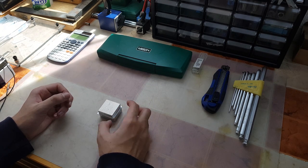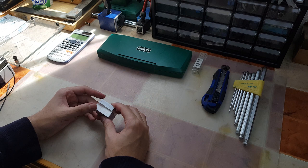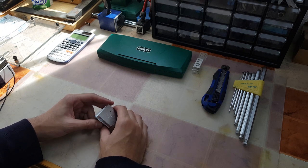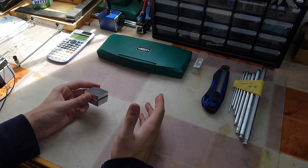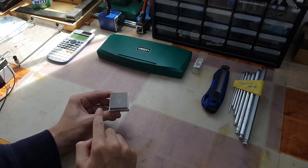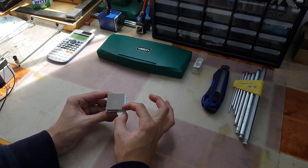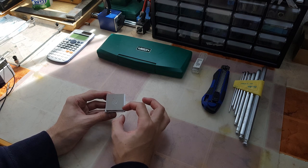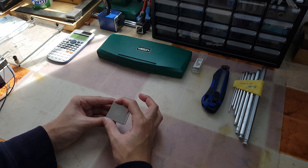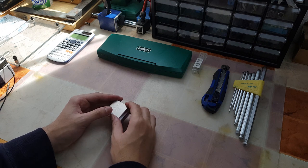The machine just finished milling this piece for the third time. The first time it was off — over 30 microns — and the Y-axis was oversized by about 20 microns. On the second test, I noticed the end mill started from one side and ended at the other, so there's a curve in the path. The most error was where the I-term was really low — I measured 20 microns over. Where the I-term was active, it was exactly as programmed. I discovered the problem was the I-term in my PID loop after that second test.